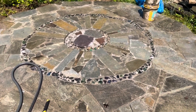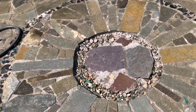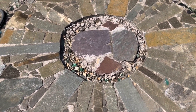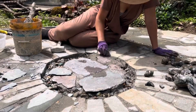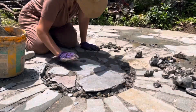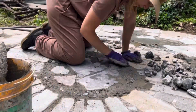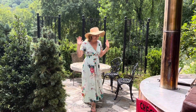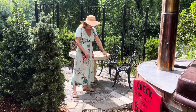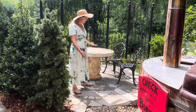The table I bought is going to go in the center. I still need to finish this part and will videotape it, because unlike the other rainy day, you'll actually be able to see the placement of the slag. For the slag, I'm putting in a whole bunch of cement, making it flush with the slate, then gently pounding the slag into the bed of cement and wiping off the excess with my glove. All the slate used here is recycled material dumped out of a quarry — that's why it's all broken up. The concentric circle idea worked out well with the string.